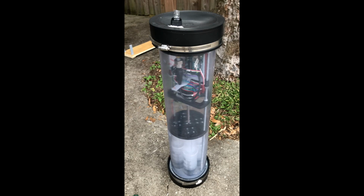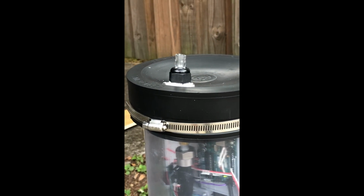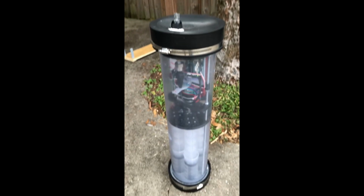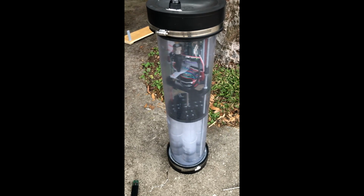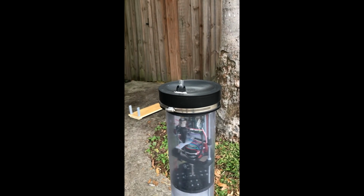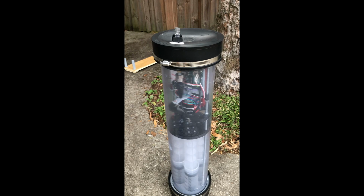So with the pressure vessel fully assembled and turned on, we'll do the cycle now. So it's pulling in water, and as it's doing that, it's pressurizing the inside. And you can see that as the back end cap sort of lifts up. And then as it expels water through the cylinders, it relieves that pressure as well, but never going into a vacuum state beyond its starting position. That's why the torque required is so important, to be able to push through that back pressure. And the more torque is going to cause a lot more vibrations, which is why we use those nylon locking nuts.